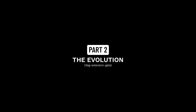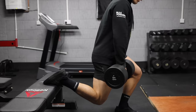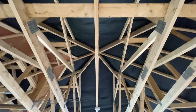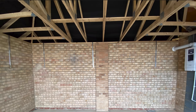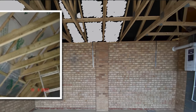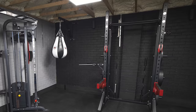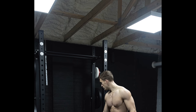Now let's get you up to present day. Going into winter 2020, I quickly realized it's cold. Whilst I got some great insightful advice from the internet such as 'why don't you try not being a little bitch,' I eventually opted to insulate the roof. There are a few options: you can plasterboard the joists at ceiling level and lay rock wool on top, you could use Kingspan between the rafters at roof level, or you could do what I did — get spray foam insulation. It's ugly, messy, probably slightly more expensive, but it's quick. If you do this, do it before everything else so you don't have to cling film your entire gym like I did.